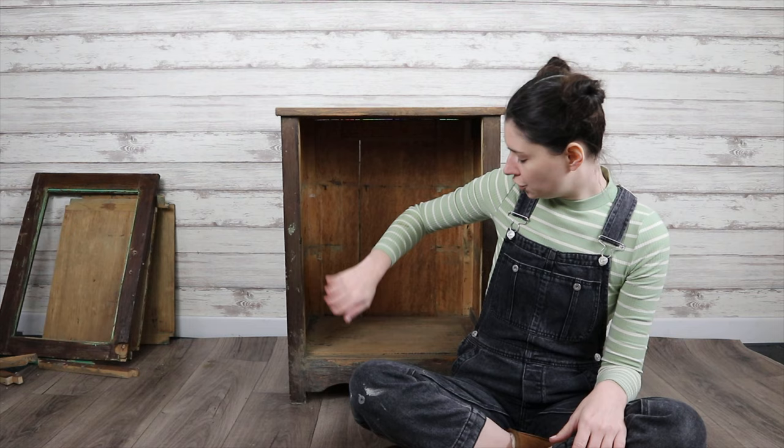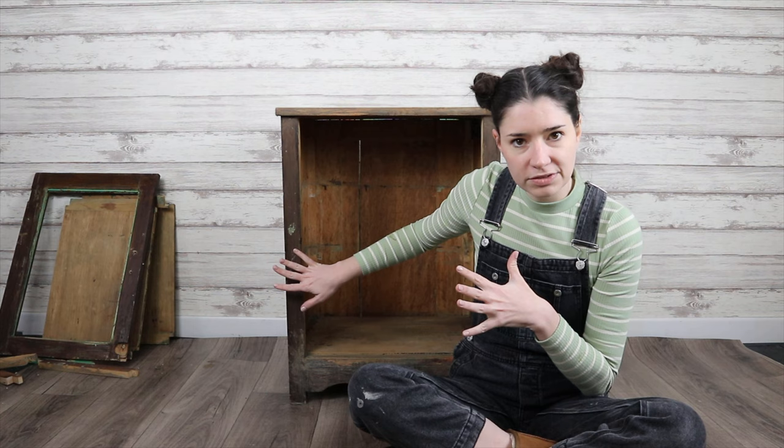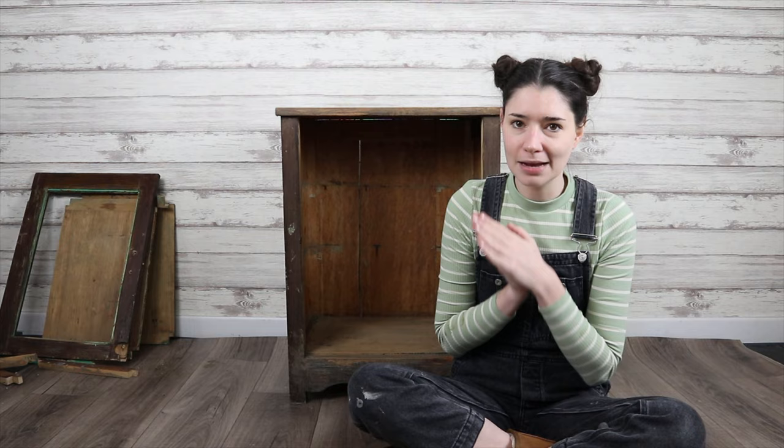During the process of applying the paint stripper and then removing the residue with acetone, I also removed the door and the shelves on the inside. I'm going to get to work on the body of this piece — remove the base, then start my sand of the top and do a scuff sand on the sides. You'll notice I didn't remove the paint or stain on the sides because I am painting this whole thing, so I'll just scuff sand it to make sure everything's nice and smooth. The top I want to keep as natural wood or potentially with a stain — I haven't quite decided yet. So I need to pop on my protective ear gear and get my dust extractor and sander out.